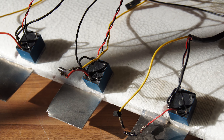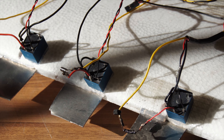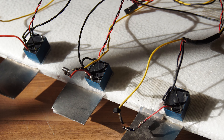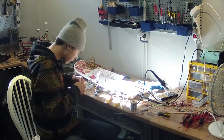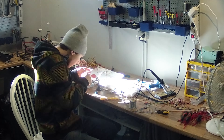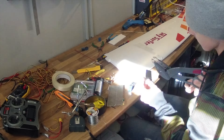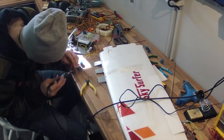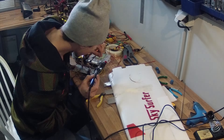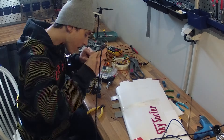I made 3 of these ignition systems on each wing, meaning I only used 6 out of these 7 outputs. The build process was quite time consuming due to all the soldering. The main reason for this is because the multi-switch can only supply 500mA for every output, so because of the current restriction I had to use relays to decrease the amount of current drawn from the outputs.